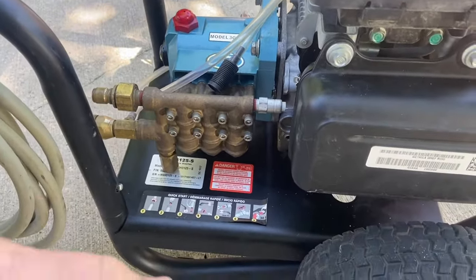You can put the head either way. The head originally was set with the unloader going down. These caps — they make threaded ones where inside there's a hole. You can put a pressure gauge on there or an idle-down feature — kind of neat. Anyway, this is done. This is the Simpson redone with a better quality CAT pump — nice unit, I just don't have a need for it, time to sell. The only other issue: this frame was bent — the guy dropped something on it and didn't unbend it. I unbent it and taped this part because it was cracked and was going to break eventually. Hope that helped somebody — give me a like and subscribe, thanks for watching.